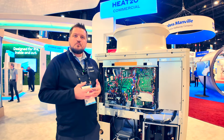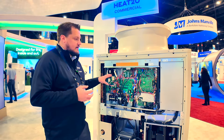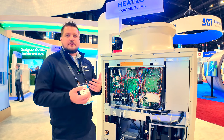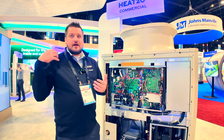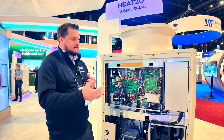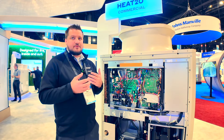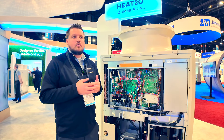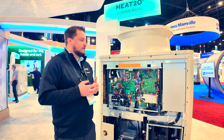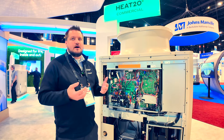You are able to share a little bit of the real-life results? Yeah, we've now had the product out for about two years in specific markets. As a system, we also have storage tanks and an electric swing tank. The electric swing tank handles the recirculation load in the building right now — we'll eventually replace that with another multi-pass style heat pump. The electric swing tank does hurt our COP a little bit because it's COP of one, but overall we're still seeing COPs in the two and a half to three range, seasonally, looking at the whole year. It really has been impressive.